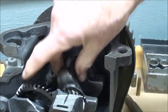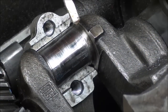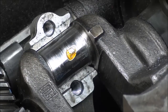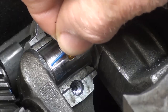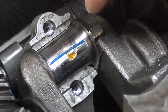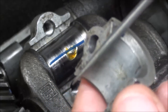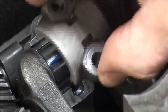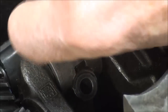I'm going to wipe the journal here of the crankshaft, and then we're going to use the Plastigage. I'm actually going to apply the Plastigage to the crankshaft journal here, using just a dab of grease to hold it in place so it doesn't fall into the bowels of the engine. You need to cut a piece of Plastigage that's about the right width. Notice the position — I'm centered, not off to the side. Then I'm going to put the rod cap back on and the bolts in place.